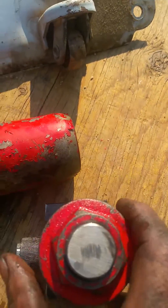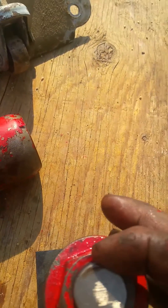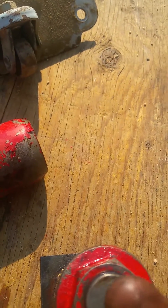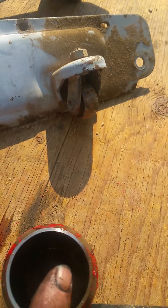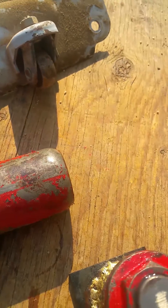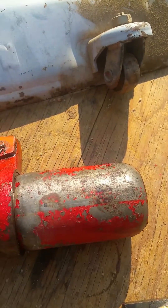I put it together and tested it out. The downside is there is a vent hole right here, which is designed so when the ram bottoms out, instead of forcing the top apart, it lets the hydraulic fluid flow back by into the original holding cylinder of the jack. That's why sometimes when you push a bottle jack or floor jack all the way up and crank it one more time, it goes up just slightly then settles back down — because it's letting that pressure bypass.